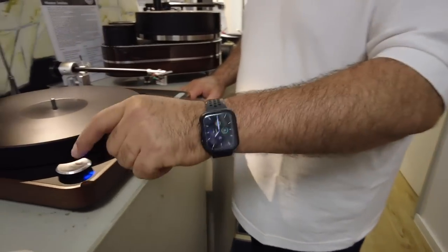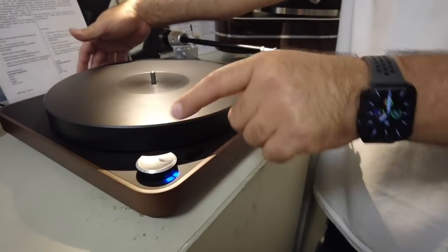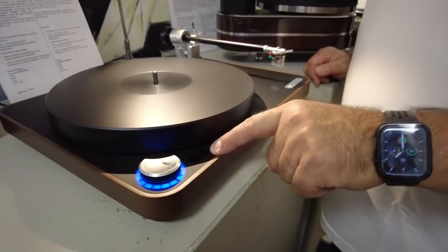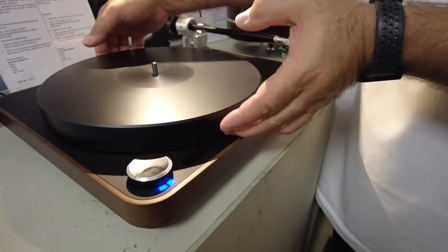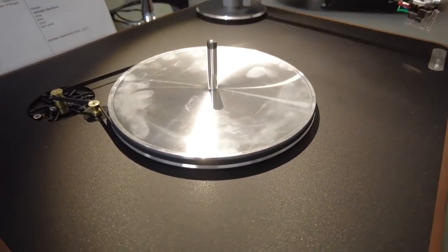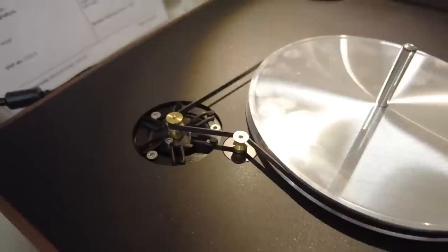So we'll show you the new Concept Signature with a new decoder push button. You will have possibilities to set the speed with a combination of pushes. Here you have the speed indication, and this is already prepared for the volume control later as an indication for the Concept Active. This is the new motor control, and this is the tachymeter with a new pulley, optimized pulley shape, and the new suspended motor unit.